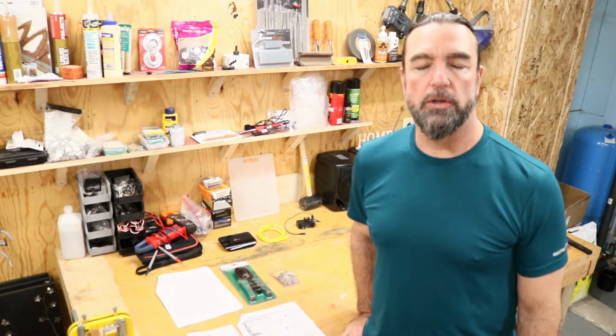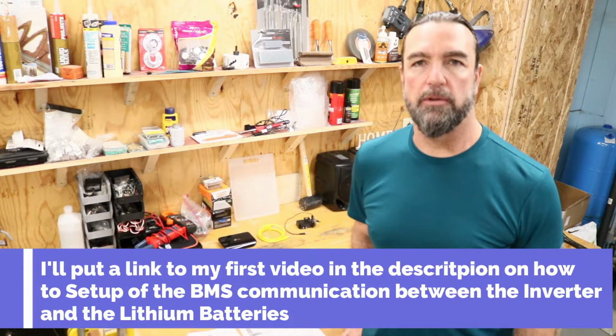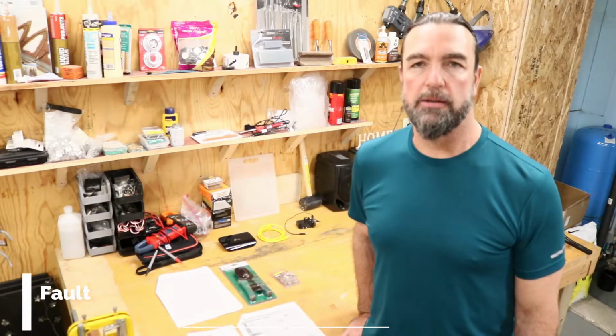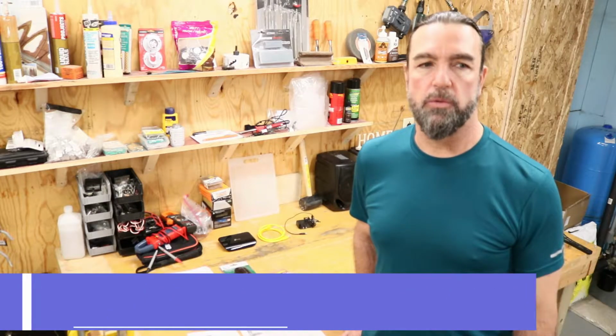For those of you who didn't watch my last video, I did a video on the integration, the communication between the inverters. I did the setup and the installation of how it goes. I did a test on that same setup on the 5000 ES inverter, connecting to the EG4 LL 48 volt batteries without a problem. We've tried it on these 3000 TL inverters with 24 volt batteries that are connected in series to make a 48 volt battery. We're unsure exactly why we're getting the error message of 20.